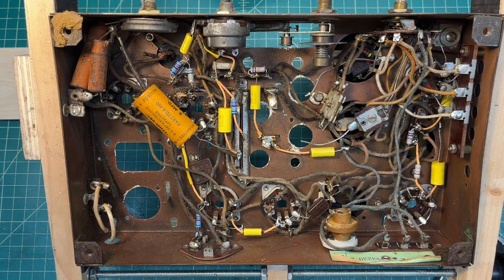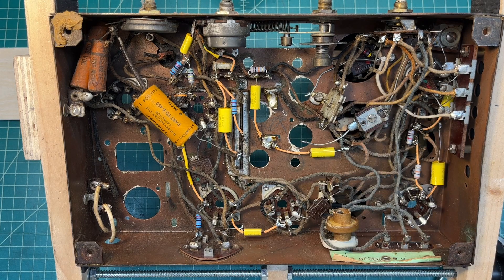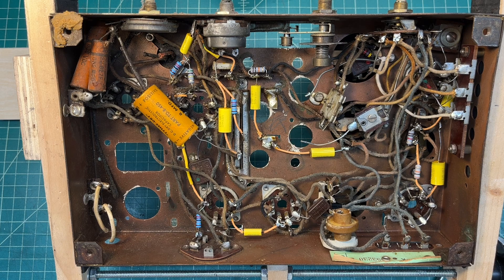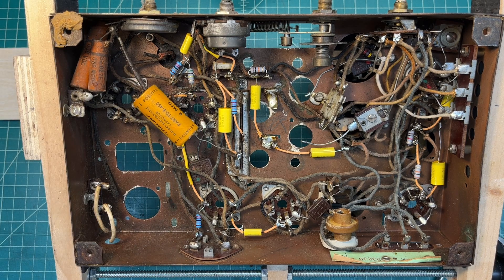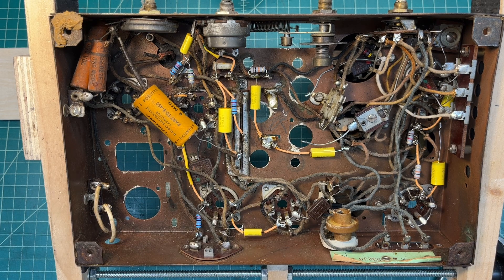As you guys can see I'm making a little progress on the chassis, getting the electrical restoration behind me. It's really pretty simple. You can see I've got my oscillator coil back in and all the resistors and capacitors replaced to this point that need to be. I've still got this section over here by the output tube and the B-plus side, but very little work left, and then a little more cleaning on the chassis that I'll show as well.